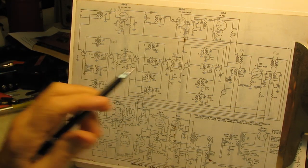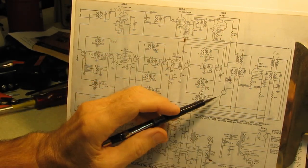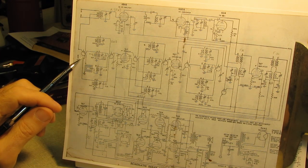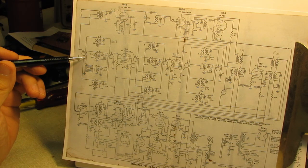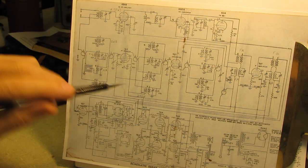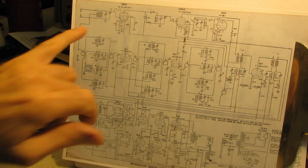And I'm looking at this, and I'm making the assumption that it's showing it on the FM band. So it'd be FM, AM, and then 1, 2, 3 shortwave bands. But again, that's not the way the schematic shows it switching into the AM band right after the FM band. So I guess that's the way it'd work. It's almost impossible to decipher. I printed out 4 copies of the schematic thinking that I would draw the connections on the different switches, but I decided not to drive myself into early senility. We'll just go with doing the alignments.